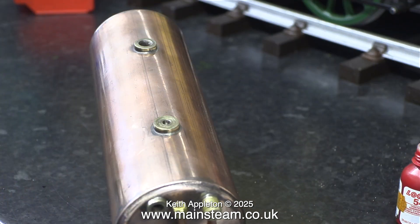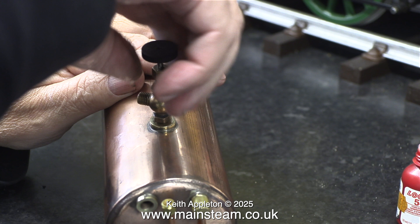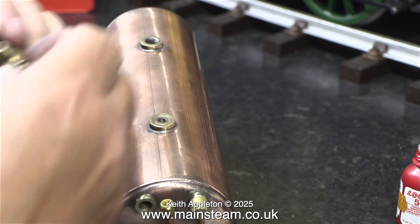The first thing I'm going to do is fit the steam tap. The bush on the top of the boiler where the steam tap fits is not very good — the top surface is anything but flat, and as the hole is 3/16 by 40 threads per inch I don't want to use a shim washer of this size because the steam tap is bigger. When I try the steam tap in position it's nowhere near where I want it to be, so I think I will level off the bush, which will shorten it slightly.